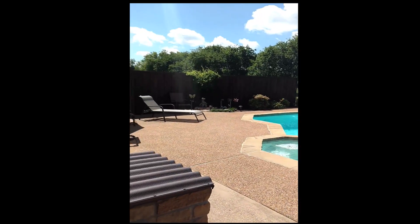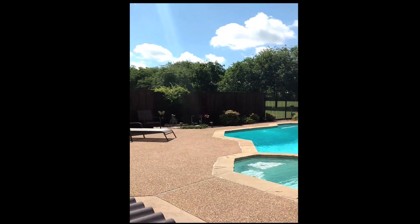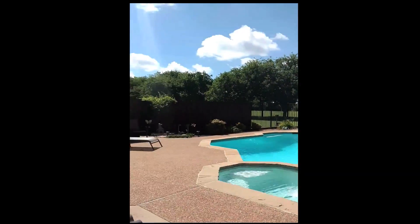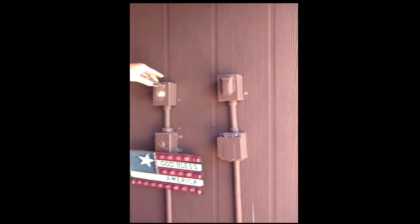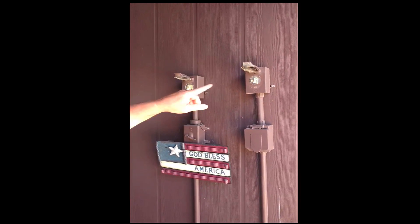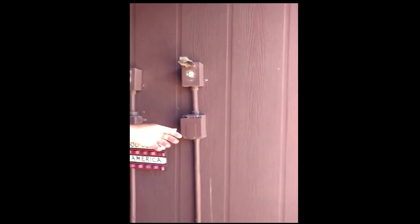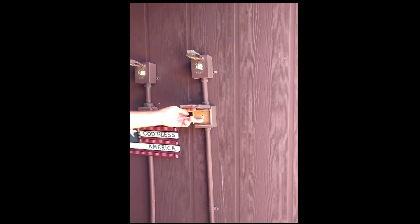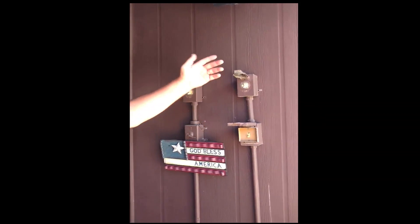The pump runs in and pumps water out. On the left side, that outlet in the corner is on the switch, and the right side of that is hot. That's the switch here. These two top ones — I think, I'm not sure which is which — are a pool light and a spa light. And this one is the blower for the spa blower that's inside the pool area. There's a switch in there for the blower, but I put this one out here so you don't have to go back in there to turn the blower off.